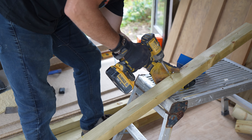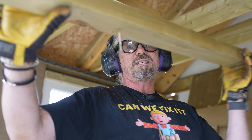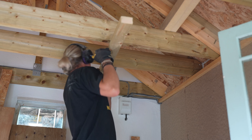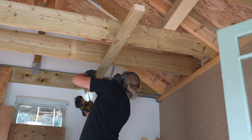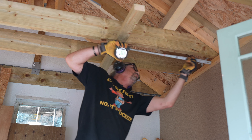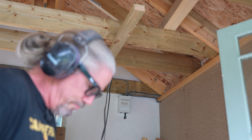It looks about right, but it's got to be bob on. I'm going to measure to the outside edge of the wall - 80mm, bob on, super. Now I just need to work out roughly where the screw is going to go and pop that in position before offering it up. I've got a lovely marker here - this knot in the wood - if I go through at that point I'll be able to hit this beam. Right, that's fixed. Let's build down from there.